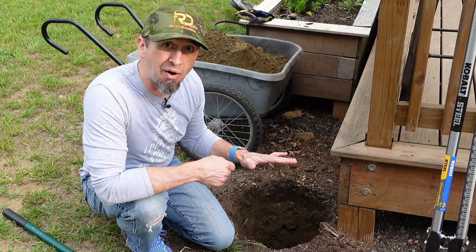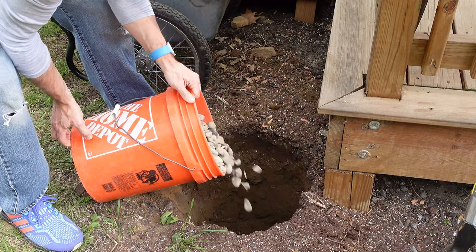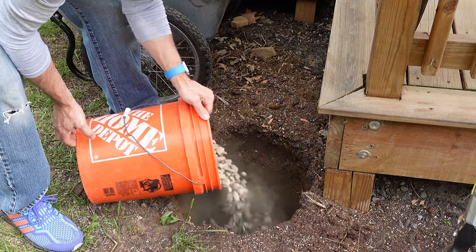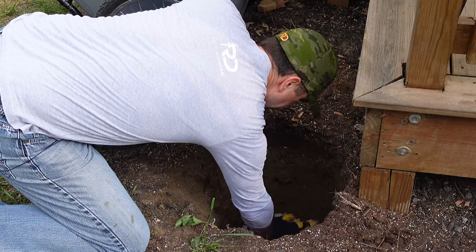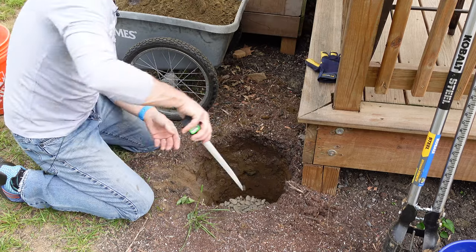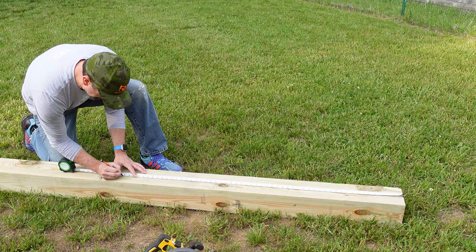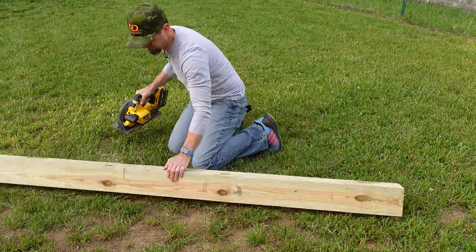I said I wanted to go about a foot and a half below grade, but I actually went an extra three inches deeper. In the bottom of this hole I'm going to put a three-inch layer of gravel. Quikrete says you should do about six inches, but I think that's a little too much — I'll go with a three-inch gravel base, and then we'll get the post in and leveled.